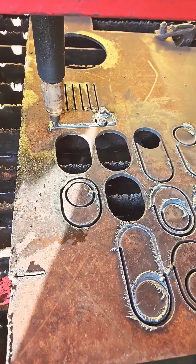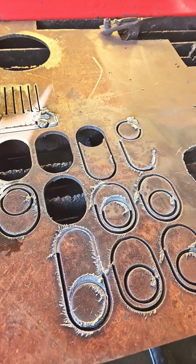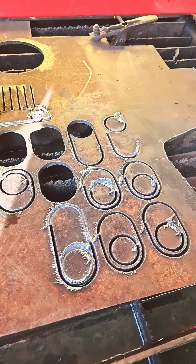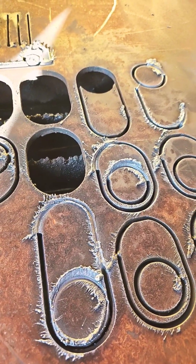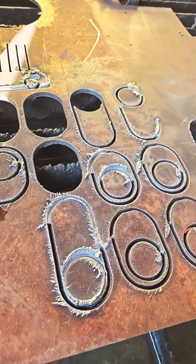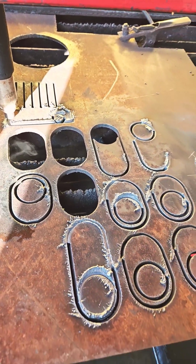Well, I had to stop it early because the cutting performance is degrading. It's a learning curve — no one's teaching me how to do this, so I'm just learning it as I go. Seems like it stopped piercing at some point, or the feed rate's a little bit too fast still, and only got a couple of good cuts on these tabs.